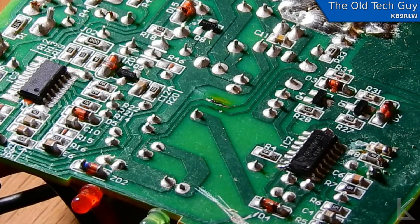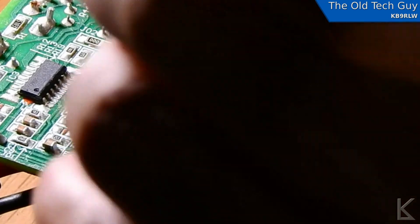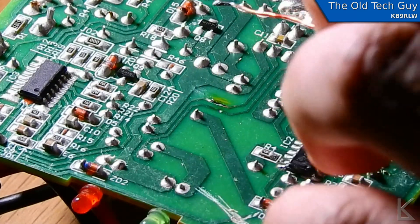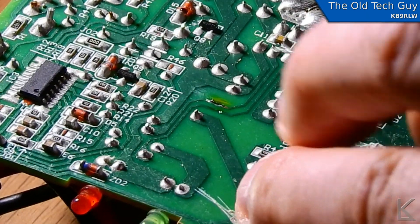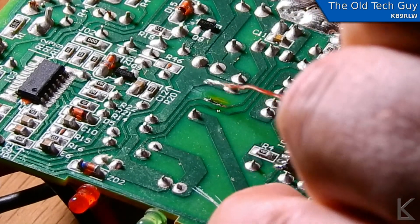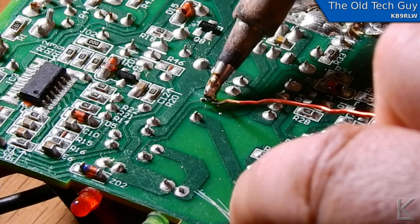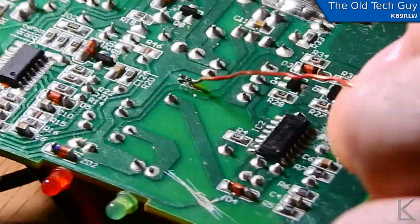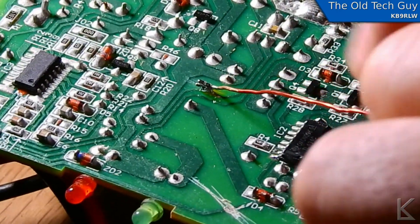This is where your hands have to be stable, and mine are not as stable as they used to be, but we'll give it a shot. I'm going to clean my soldering iron tip, put a little bit of solder on it, and lay that flat piece right on that trace. It might help to use your other fingers to grasp the board to give yourself some leverage and keep yourself stable. I'm just going to hold that on top of the bared trace and put a little pressure on it with the soldering iron. The solder will melt through — I felt it grip, and there we go.